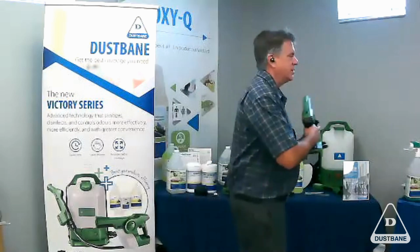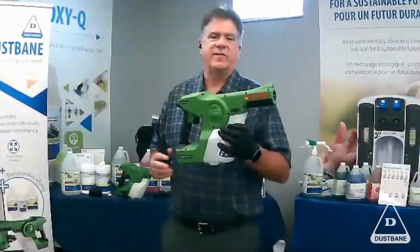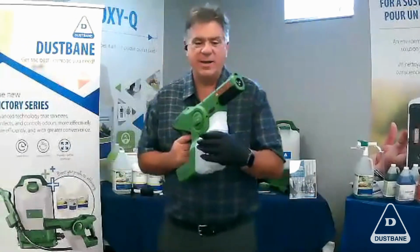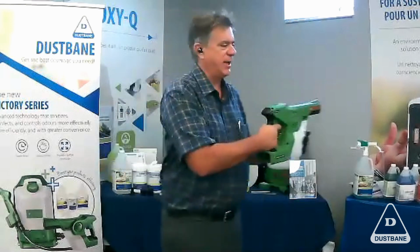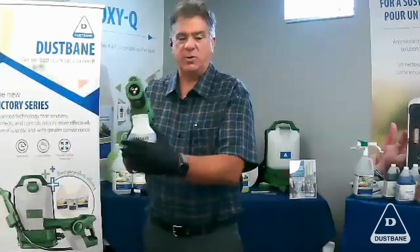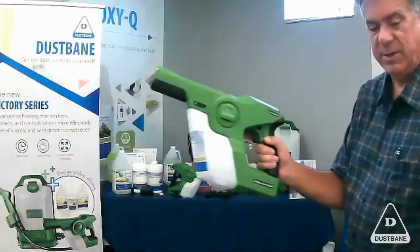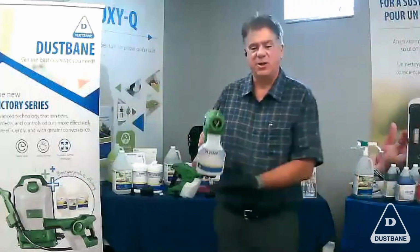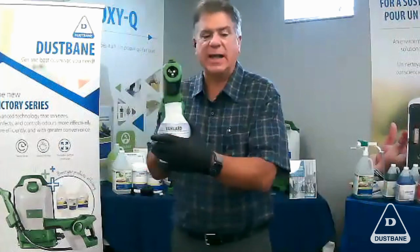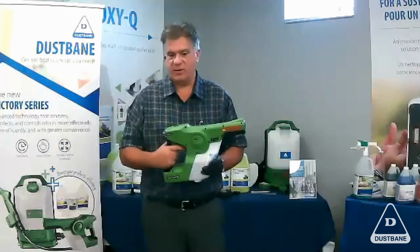So make sure that you're handling the system properly. You notice I'm wearing one glove and the other hand I'm not. This glove is because I'm handling chemical all the time. This hand is because I'm the ground. Little tidbits. Operating, my favorite position to get the best wrapping is the way I'm holding it now, because I'm grounding myself, and I'm also allowing my hand to keep position properly. Because when you're doing this, eventually you're going to get fatigued. You're going to start releasing that handle. You're going to lose your ground. You're going to build static. Holding it properly will allow you to get the best coverage as you're operating the machine. It's the best way, it's the recognized way, it's the safest way.